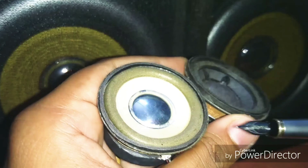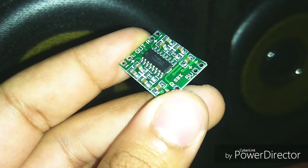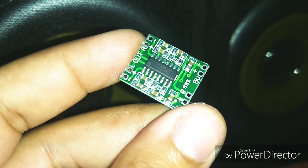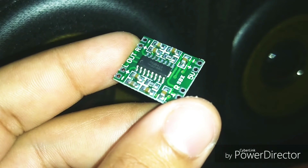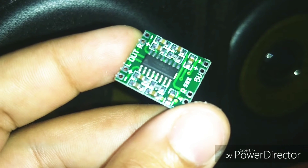The current value reached a maximum of up to 0.25 amperes for 8 ohm speakers. But for the smaller 4 ohm impedance speaker, the current reached more than 0.5 amperes. From the test results, I concluded that if you want more power delivered from this small amplifier, you should use a 4 ohm speaker, or you can use two 8 ohm speakers in parallel — using 4 speakers, 2 for each channel.